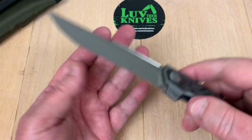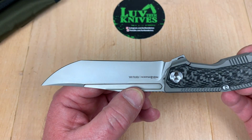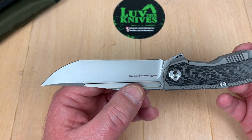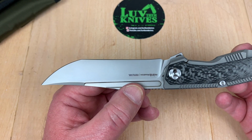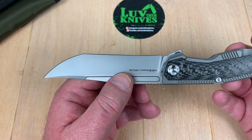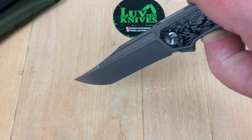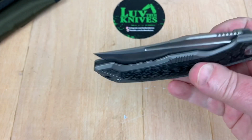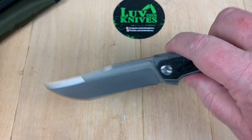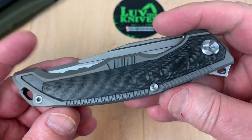Yeah, I could strop this thing up, and I think if there is a slight recurve there, you're probably going to take it out pretty soon if you sharpen it a couple times with a flat diamond stone, because you're probably going to have to use a diamond stone on M390, especially if it's actually a 60 Rockwell. I had to send this to BJ and get him to Rockwell this sucker. I need to put a box together for him anyhow.